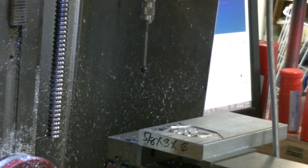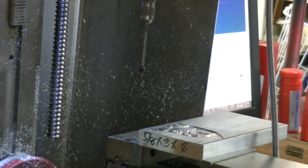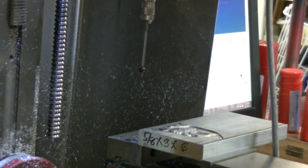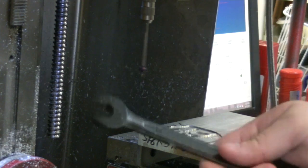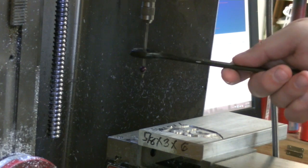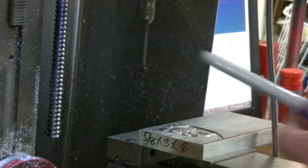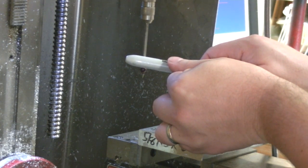It's a quarter inch. You've got a couple of options on setting your zero. First thing we do, we get it going and it's wiggling around. I've seen people use wrenches to go in and straighten it that way, but I find I don't get quite the same result. I like to use my Sharpie — I come in with my Sharpie just real gently and I feel like I get a little bit more control over what I'm doing.